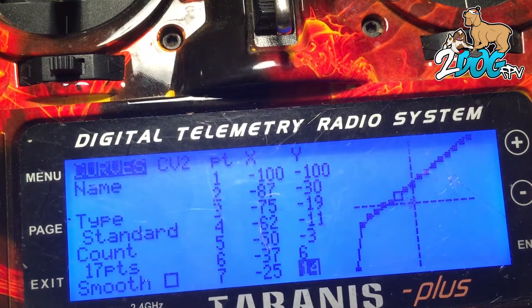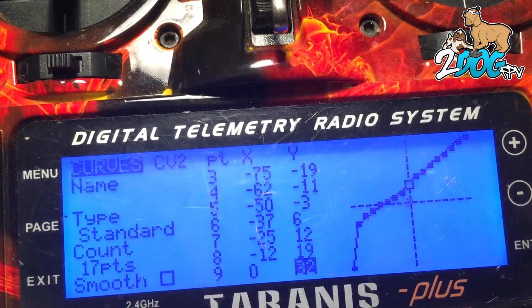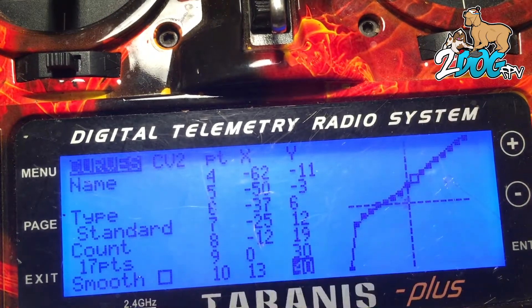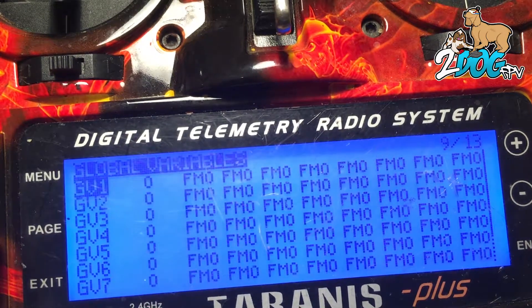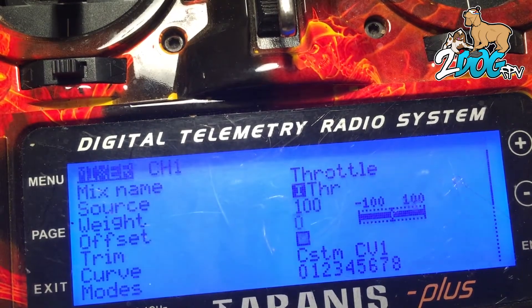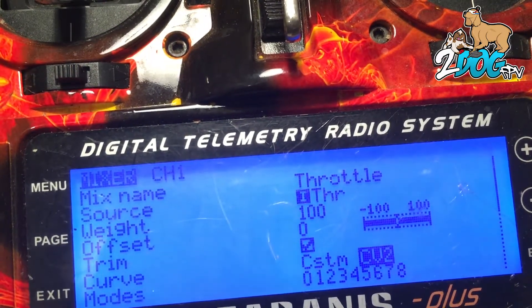It's going to give you more precise control in the middle. So it kind of flattens out there, and then it'll spike right up — that'll give you more sensitivity right in that spot. But you can kind of fine-tune that. So that was curve 2. Then you can hold down the page button and go back to throttle, edit, and if you wanted to use that one, put curve 2 in there. Go fly it, see which one you like. I've got some more tips coming up — I'm going to have some more OpenTX tips coming up shortly. And I've got this torque frame that I haven't reviewed yet that will also be up on the channel. Thanks for watching.